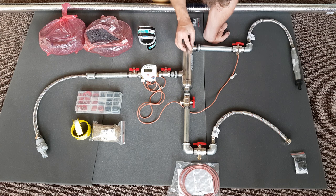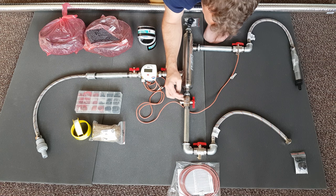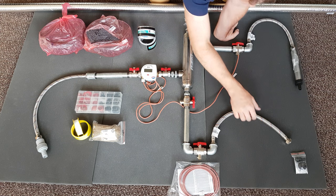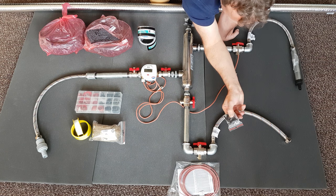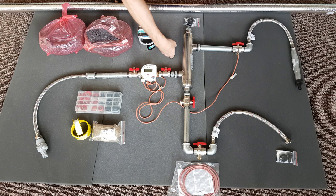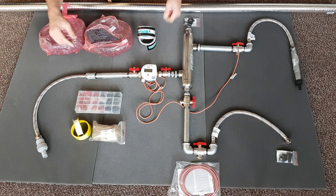The flexible hose will be positioned so that the condensation level does not rise above the vacuum bleed port. The water will condense, come down, run inside and fill up to a point below the vacuum bleed. Ryan has also brought a pressure release valve that we may attach up here — if there's too much pressure and it can't release, the pressure can come out there as an emergency. We also need another three-quarter to three-quarter fitting to attach the bleed hose for the condensate. So that's the condensation path, and this is the hot water out port and the input water from the mains supply.